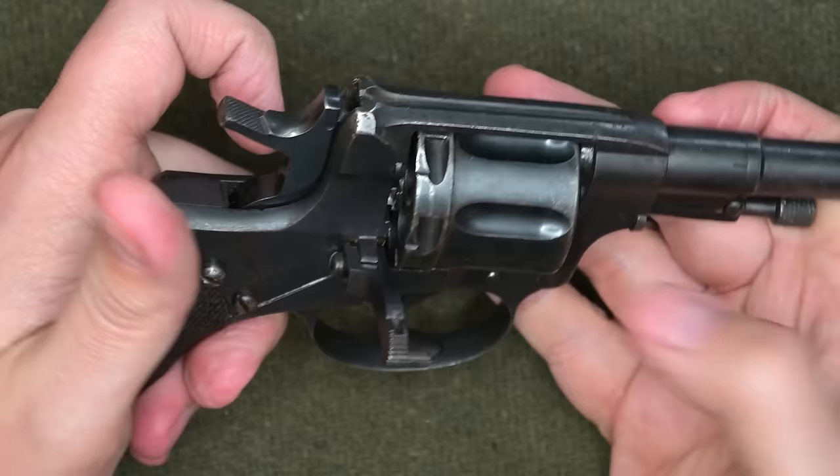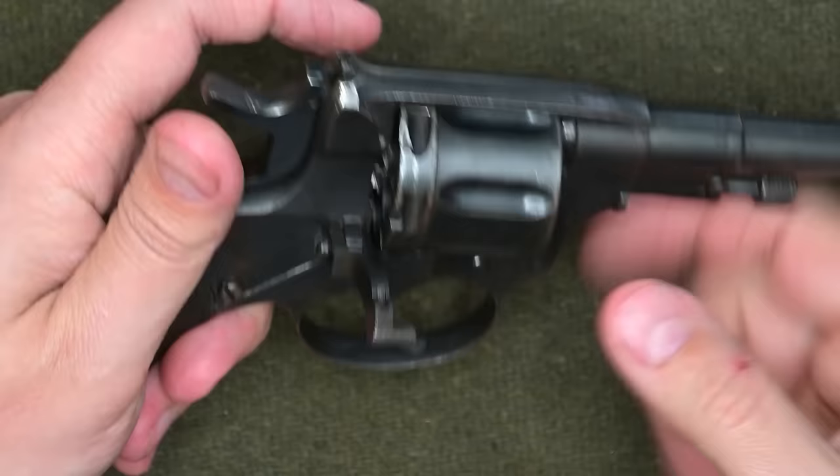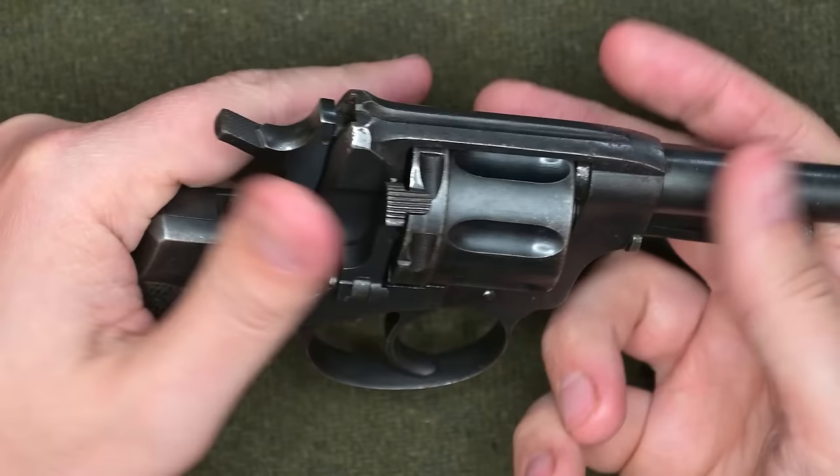It's when you release the trigger. Then the hand goes skipping down the back of the ratchet teeth again. And if you had, let's say, 3 or 4 empty rounds here and several loaded rounds on the other side, because it's rotating that way, you could be in a position where this wants to rotate one click back, and then you'd fire nothing when you pulled the trigger again. In order to avoid that, the gate prevents it from happening. We can see this a little bit better from the rear.